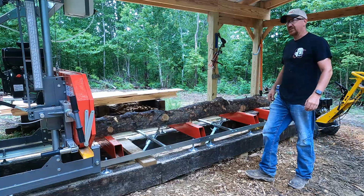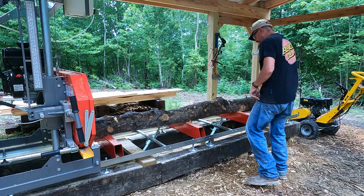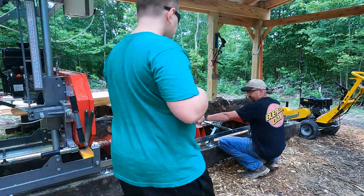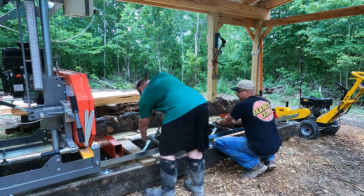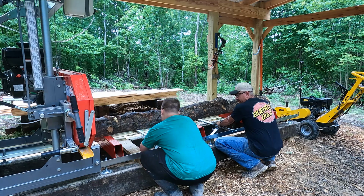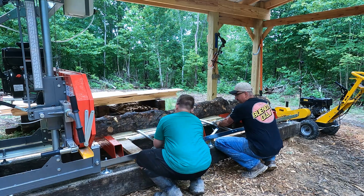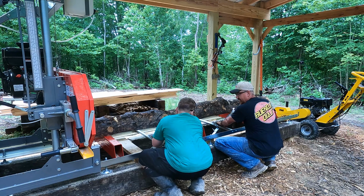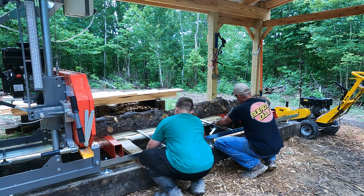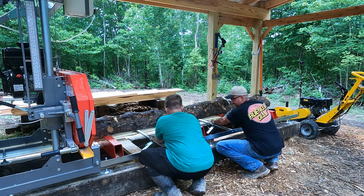You wanna put the log dogs in it? Come here, I'll show you how. We'll do them together. Pull yours out right there. Grab that one. Now, pull it out here. Raise it up. So open this thing up. See the paddle? Now, put a hand down here and push this spike into the middle of the log from the bottom.